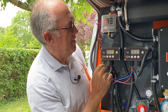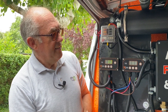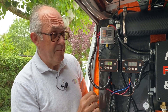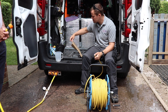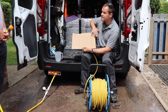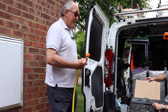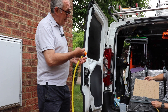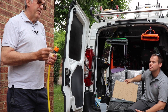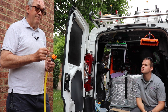We're going to increase the controller to setting 30. What we might see here is it reaching the calibration level, so we may need to recalibrate the controller - the pump is having to work harder to move the water through the smaller hoses. With the half-inch hose results in, the flow rate increased as the setting went up, but the pressure stayed exactly the same all the way through at zero. What this shows is that the hose can carry a maximum amount of water - for the half-inch, a little bit over three litres a minute. The pressure doesn't change because it's not pressure giving us the flow; it's the hose and the pump generating the flow rate.